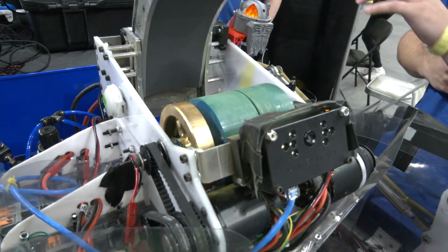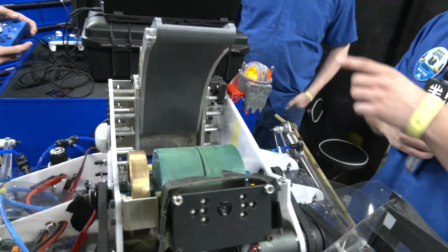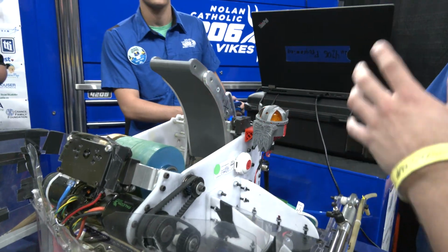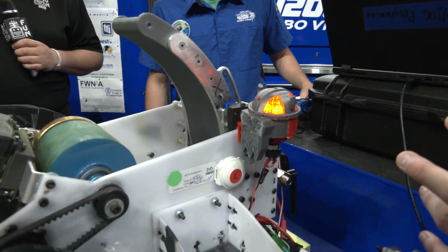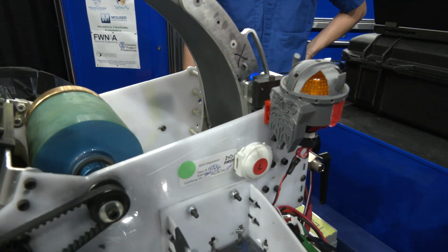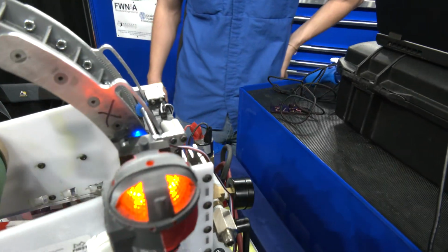Our shooter hood is run on 2 servos in the back, which allows us to have different angles. If Andrew wants to show us right here, going up will make us shoot lower. And originally we were going to adjust this mid-match, but we found our best angle in between that. And in tandem with the flywheel, we got a lot of pressure on those balls to then fly out. That's what gave us a lot of our offensive position inside of the trench right there.